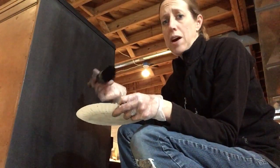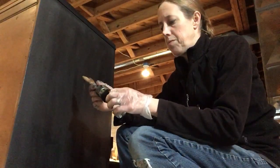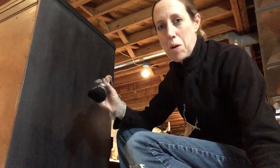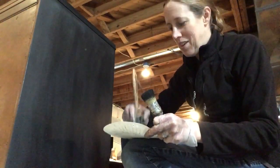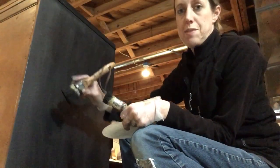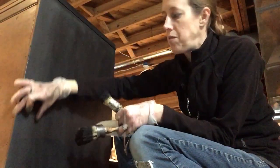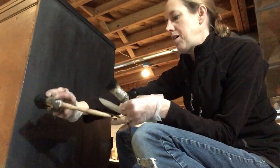I just have an old wax brush or paint brush that I'm using — any decent-size wax brush or paint brush will do. This one is old and bristles are falling out all over the place, so this will probably be the last time I wax with this one. When I do this, I do a large area at one time and work quickly. The mistake I made the first time was working in narrow sections, which looked very streaky.